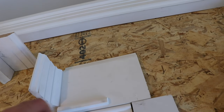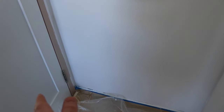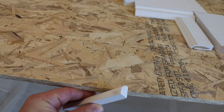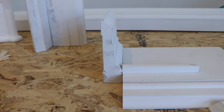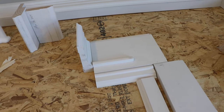If you wanted to terminate this into that you can do it if you're that lucky — that's not going to happen in this room. With that trim I'm going to have to scribe it and get it into the corners as best I can. For the baseboard I'm going to have it terminate into the wall — kind of like a return under the bullnose, but not a 90-degree return. I'm going to do a 45-degree turn so it's going into the corner like that. I saw that in one of Gary Katz's videos and thought it was pretty smart.